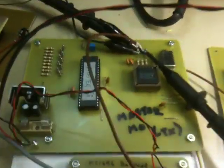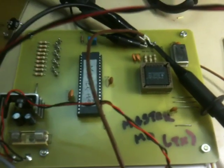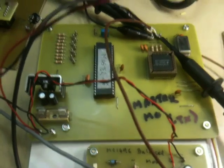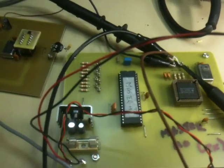On the bench, this is the transmitter which consists of a direct digital synthesizer — a DDS chip, an old AD7008 — programmed by a PIC 16F877.